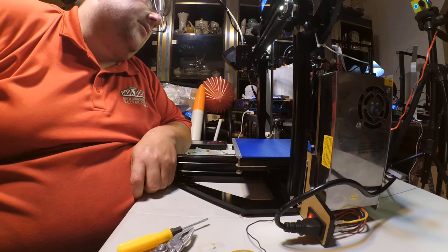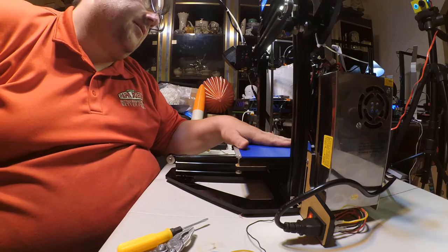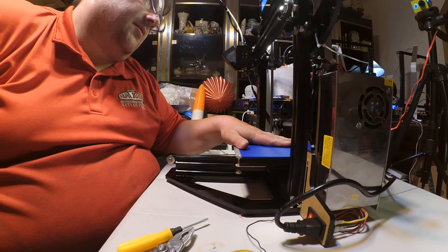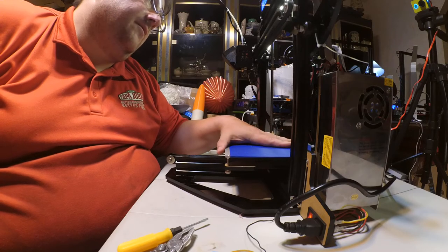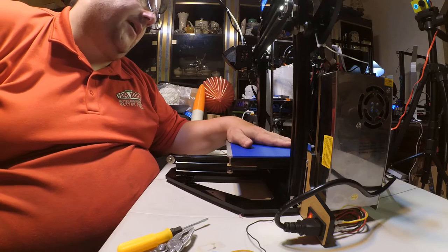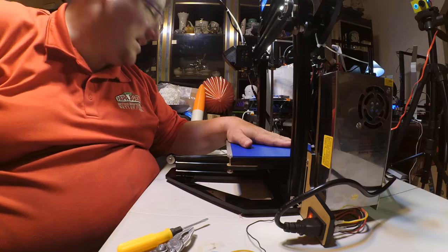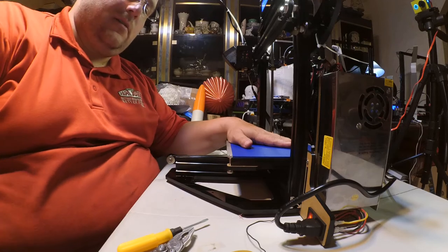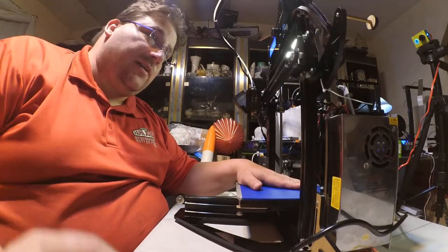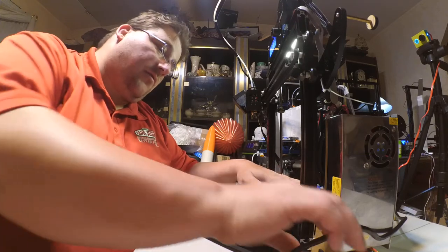All right, there is already an error. The heat bed is giving me 21 degrees. So that's working, but I am not getting a read from the... yep, it's warming up with just my hand on it, 22 degrees. But I get a DEF, which I'm assuming is defective, when it tries to read the thermistor from the hot end. So something's plugged in wrong.